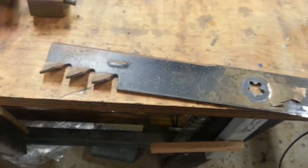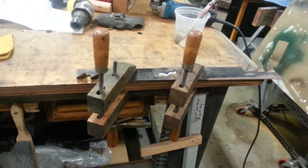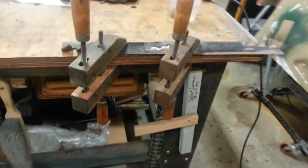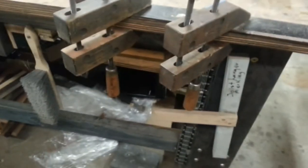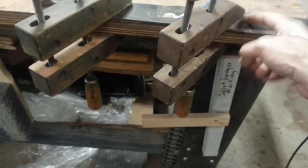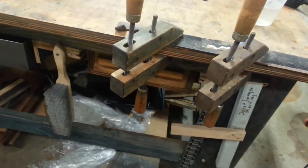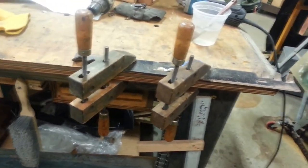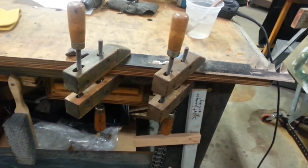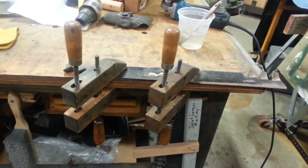This is just a mower blade, but anything that might fall off on your foot or come loose and snag you somehow — best to use two clamps. Here we've got two Jorgensen clamps. If you haven't used Jorgensen clamps before, keep the sides of the clamp parallel for the best clamping force. Typically you first tighten the clamp closest to the jaws, then for real tightening you get more leverage from the outer screw — tighten that up and then crank down. That way if a clamp vibrates a little bit, it's not going to fall off on your foot. I really suggest doubling up on clamps on anything that might be problematic.